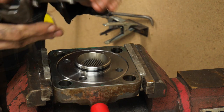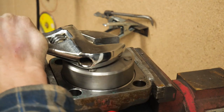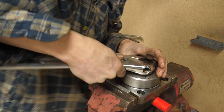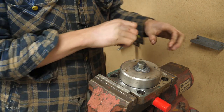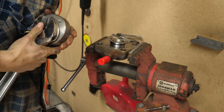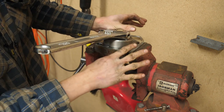We'll see if we can crack these threads open. Something tells me my weld is not going to hold — I'm going to have to get a hammer. Let's flip this around. So the centre of my vise is here and I've got this long lever arm with a lot of leverage on the vise. If I instead run it this way so I'm putting the force here, chances are I'm not going to twist the vise at all — the force will be centred. Got movement. Hydraulics don't store that much pressure because it's an incompressible fluid. This being an accumulator, it's effectively a big spring in the system, so there is potential if something has spurt out.